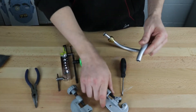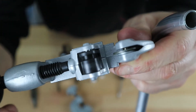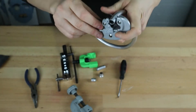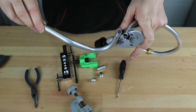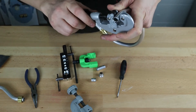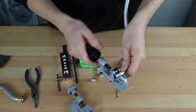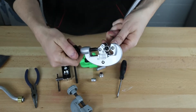Now that your tubes are prepared after your cuts, you're going to take your roll groover — that's the one with the washers in it. The roll groover has a couple of washers: one washer holding it steady so it doesn't go back and forth, and one washer for doing the groove. Make sure they can spin around. I will take my existing tube that came off of the air compressor and measure the distance to make sure I get the grooves in the same place. Then I put the washer down, tighten it, and slowly work it the same as though I were doing a cut — slowly working it around, a little bit tighter, a little bit tighter.